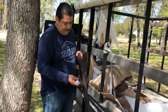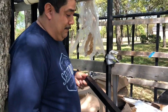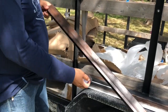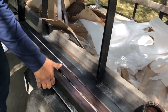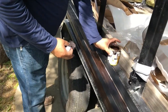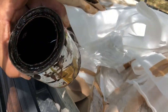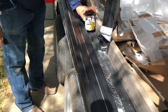Juan has got the brick mold over here and they're painting it to match the door. It's actually a plastic brick mold — it'll last a lot longer and will hold the paint well because this is a special paint. It has some copper in it. They go ahead and prime it black and then hit it with the special paint, and it looks just like the door.